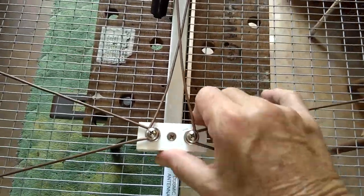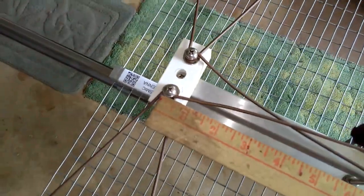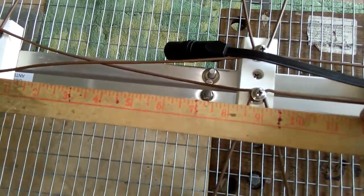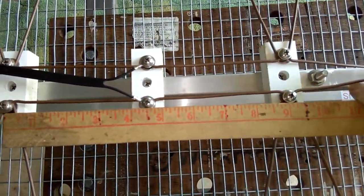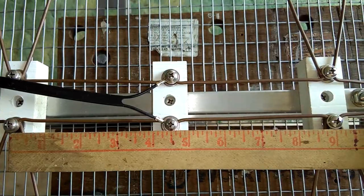The overall length of this antenna, top to bottom, is 28 inches — from the bottom of this insulator to the top of the top insulator. In that 28 inches, you set your insulators on center, come down a half inch, and then your bays are nine inches apart.